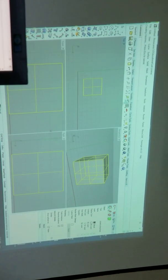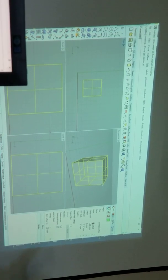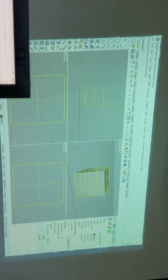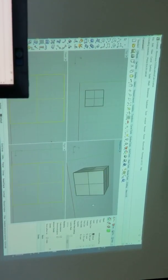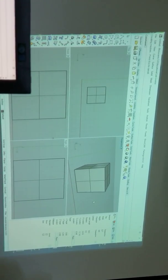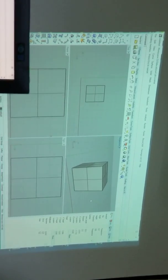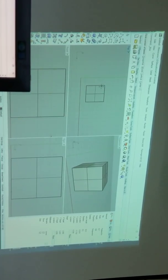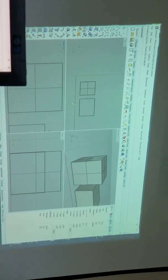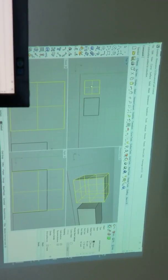Meaning, the corner of this surface and this edge of this surface touch each other within a 1/10,000th of an inch. There can be like no error in the drawing. So, if you're in the practice of drawing surfaces as individual two-dimensional surfaces, you're going to want to get away from that practice and start thinking about sticking to just solid things the whole time. Because when I draw that box to begin with, it is automatically a solid. But if I draw an individual surface, I'm going to have to be really careful about making it into a solid that I can print.